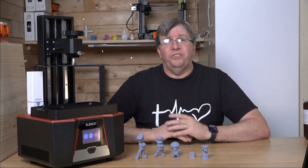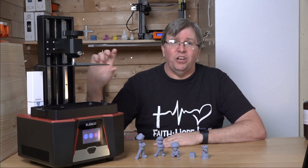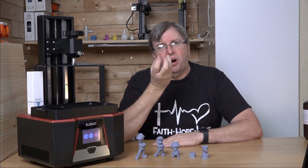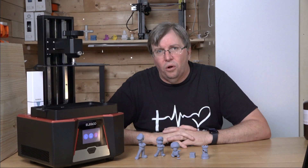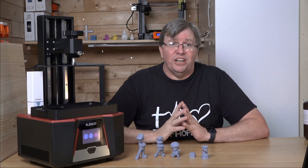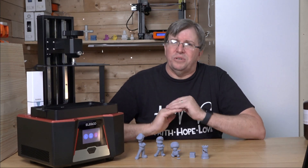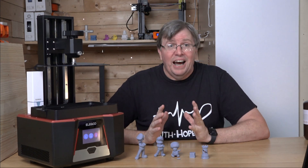This machine is quiet, easy to use - you just get started and away you go. Here's a useful tip: when printing, press pause and the build plate moves up so you can actually check if the part has adhered to the plate. If there's an adhesion failure you can stop early rather than wasting hours of print time. I used this trick with the Eiffel Tower print and there were zero flaws in the final result - there's no way to see where I paused it.